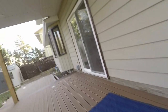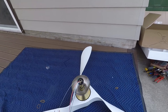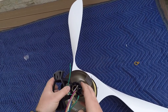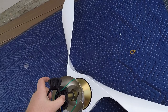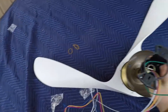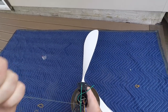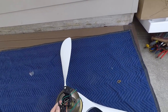This goes up on your fan box on the ceiling. All you do is hook it like so — you take your ceiling mount and it slides like so, then rotate it so that it locks in. That's basically all it is to it. Hook up your remote with your extra wire, make sure to mount your safety chain so that if the worst case happens it can hold everything. Then just test it and go from there.